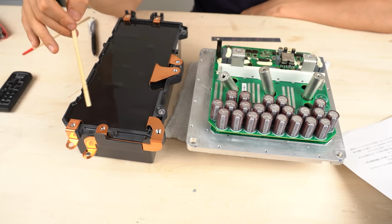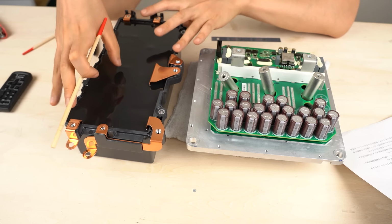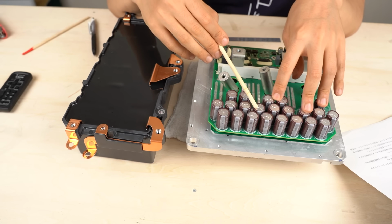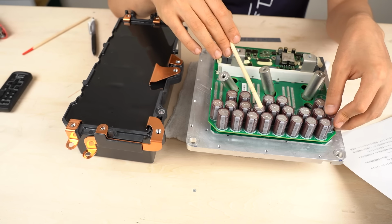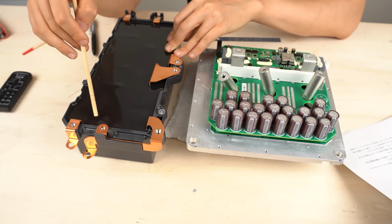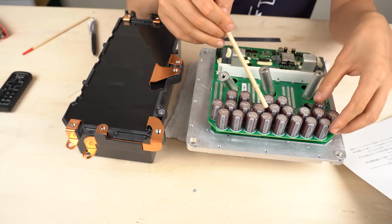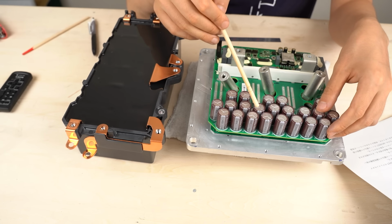This is a film capacitor for an electric car. Recently, electric car battery voltage is high, so a film capacitor is essential for such cars. However, this electric car's battery voltage is only 96 volts. Therefore, aluminum electrolytic capacitors can be used. Film capacitors are commonly used for electric cars to smooth voltage also because film capacitors have low ESR. But this electric car's battery voltage is only 96 volts. So considering the cost, aluminum electrolytic capacitors were the best to use, I suppose.